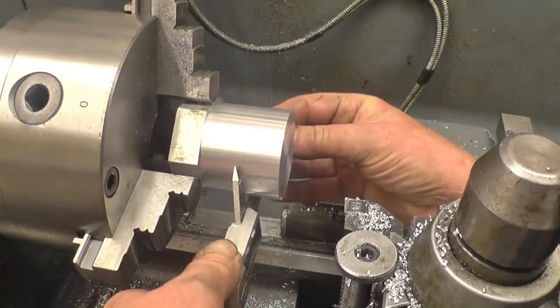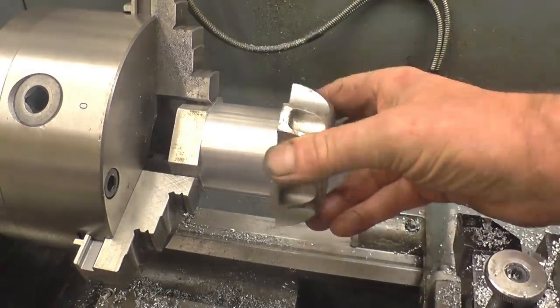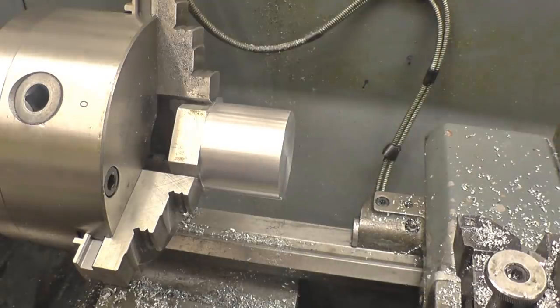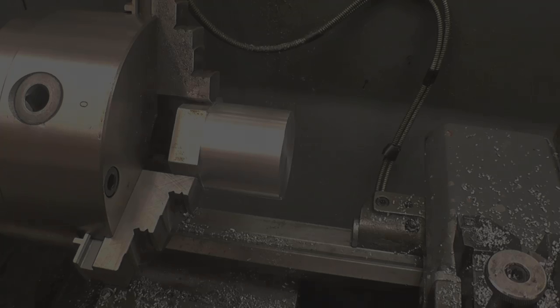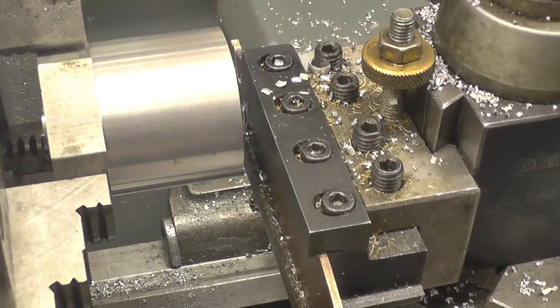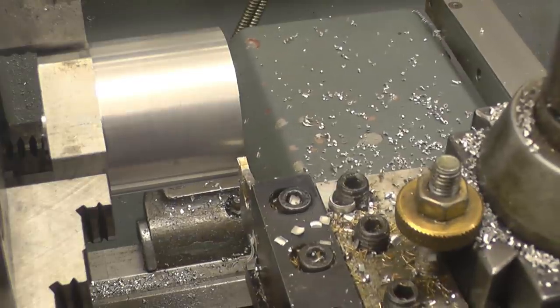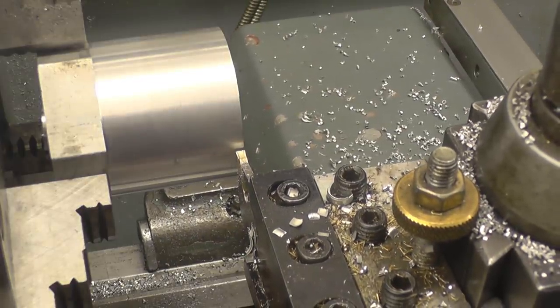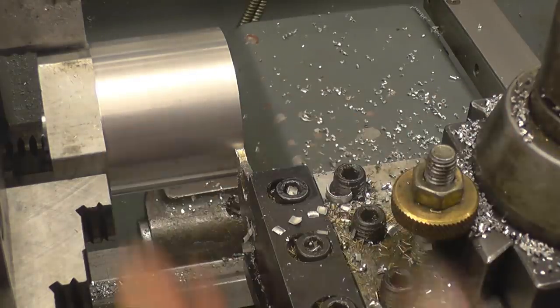It gives us 55mm dead, which will be enough to get that thread. The original threads are only 53, and that's very slack, so that'll be good on there. Maybe the depth of the thread or the length of the thread. About 23mm thread from there. Then we need to go down 10mm, 5mm per side.